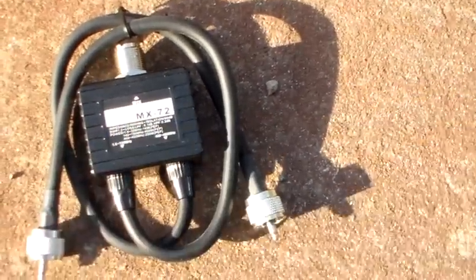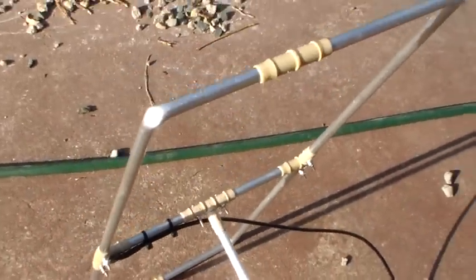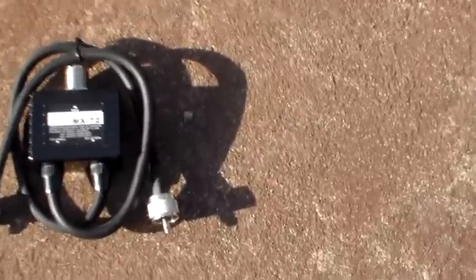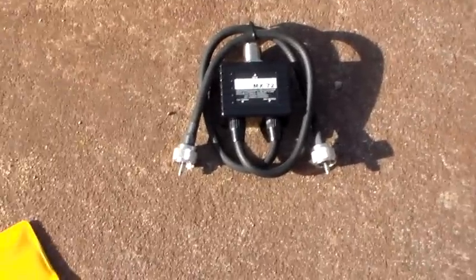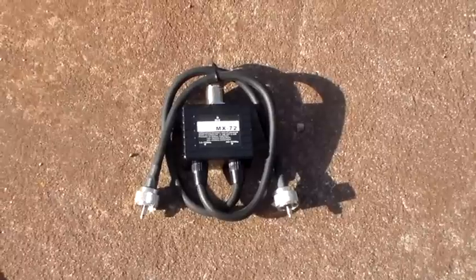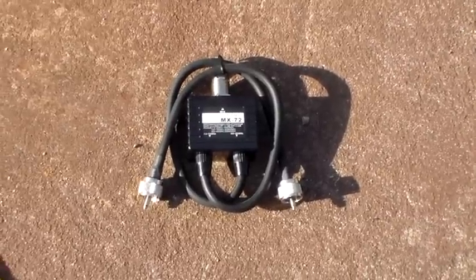So I'll take this to work, stick it on the analyzer and see if it needs a tweak. If it does I'll give it a tweak, if not I'll just install it. So just for clarification then — our Moxon 2m antenna is purely for 2m. There will be one about a third of the size on the other end of this boom for 70cm — two completely independent antennas fed with one feeder through the diplexer. I hope that might have cleared up any confusion from the previous video. Hopefully that's painted a clearer picture of what I've got in mind. As always, thanks for watching and I'll catch you next time.